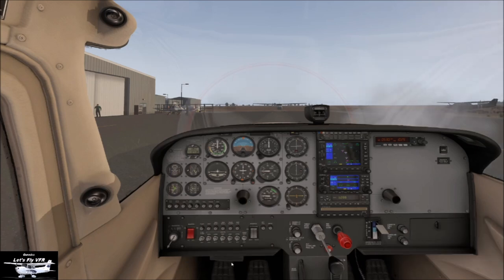Okay, all back. So let's just quickly check everything. We'll put our park brake on for a moment, and we do need to do one final check of the electrical system, and that's by not putting the power up as we did previously, but bring it back. It just dies away a little. Back up. Back to, so we turn the other magneto off. What we want to know is it hasn't failed while we've been flying. That's all good, so let's put it back up there.